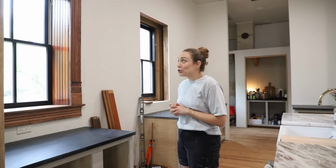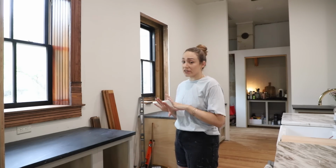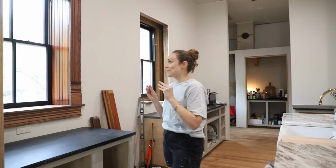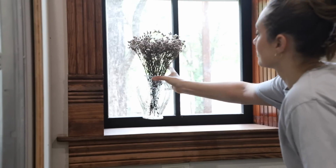It is beautiful, but I think it's gonna look even better when we wait about a week while this really dries and put a sealer on it. Because what the old one does have is a luster to it. I'm not gonna get that luster with just stain alone. I'm gonna have to put a layer of sealer on top. So we could do a satin finish and have it be the same kind of sheen, and it's gonna help further make it match. But it's stunning. Let's put something in it. I could just put pretty things on it.